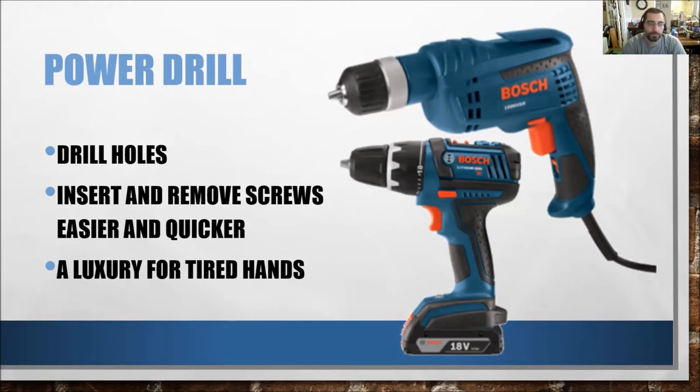A drill will also come in handy when you want to hang objects on the wall. You would use your drill to pre-drill a hole into the wall for your screw, and then use the drill to drive your screw into the wall. If you're drilling into a wall and you hit a wall stud, you can simply drive the screw into that hole. To know if you're hitting a stud, you'll need a stud finder — which will be our next video. If you drive through the wall and don't hit a stud, you will need a wall anchor to hold your screw in place, which will help strengthen whatever you're hanging.